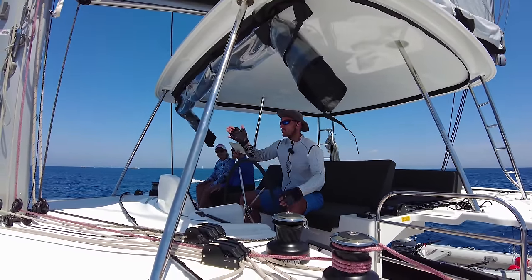Well, we're gonna furl it for now until we get better wind. There's two ropes, you have to pull the right one just because the UV sun protection is only on one side. So we're gonna be pulling this rope. Okay, this one. And we don't wanna chafe it over this one, right? So just pull from here. But as I start releasing, okay? So we'll be pulling and I'm gonna be releasing the... Are we pulling it back now? Yeah, we're furling it back, yeah. So just to open the sail, air it.